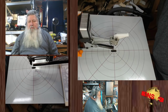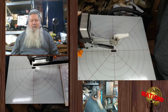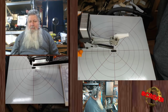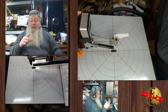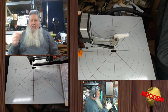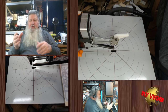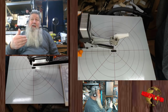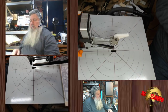Who can answer a scroll saw question? Mine pulls to the right, straight push. They inherently do that. The DeWalt does that, Matt. You have to correct the wood. You have to turn the wood because it's actually not the scroll saw's problem, Matt. It's the blade. Most blades are stamped out, and they're stamped in such a way that they have a burr on them, and the burr has a tendency to make it want to cut to the left or whatever, so you have to steer your wood to the right.